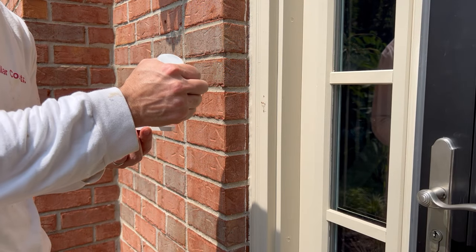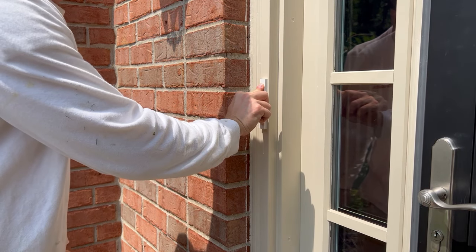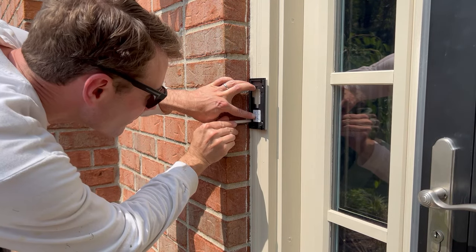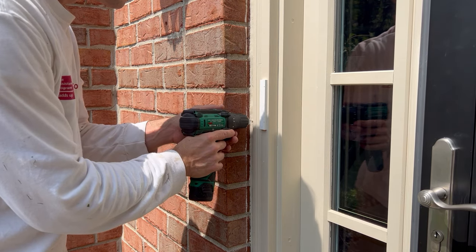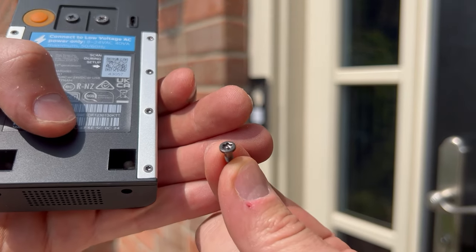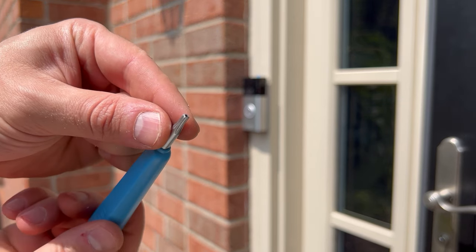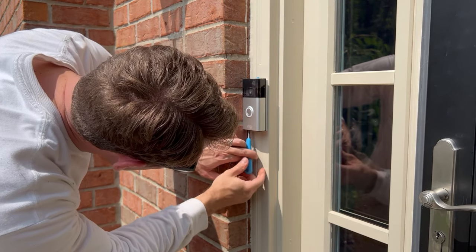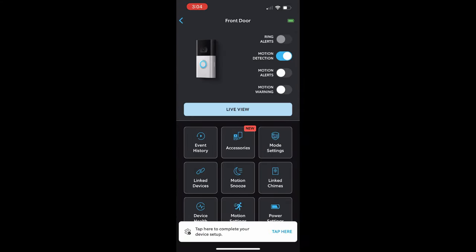For the physical install, it's very straightforward if you have some wood to screw into. Door trim often angles the camera, so Ring sells a trim kit that can help mount the doorbell accurately, but in my case I used a piece of PVC trim to even things out and then used the supplied screws to fasten the bracket to the doorframe. The doorbell then screws to the bracket with these security screws, which is kind of fun to me because everyone who has a Ring doorbell now has one of these specialty screwdrivers and knows how to steal one off your house if they really wanted to. But since everything is tracked by QR codes, I'm not sure how successful the Ring black market is and I'm not going to worry about it too much.